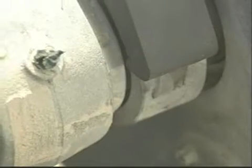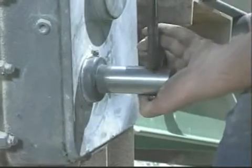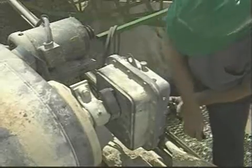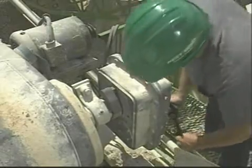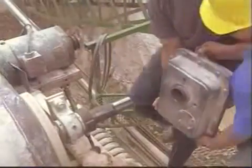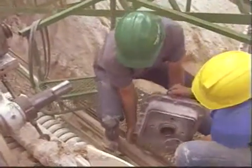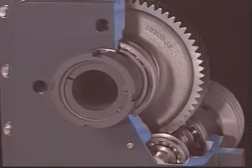With the bushing nut locked in position, rotating the high-speed shaft makes use of the drive's built-in torque multiplier to provide the axial force necessary to loosen the nut and free the unit from the taper. With Quadrive, you get sure, positive drive removal every time without the risk of drive or bushing damage.